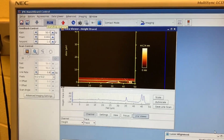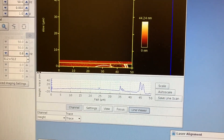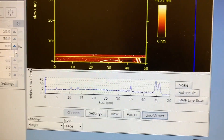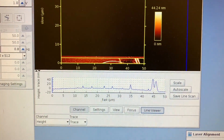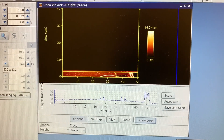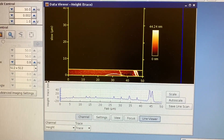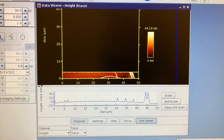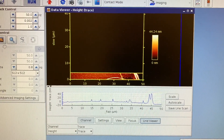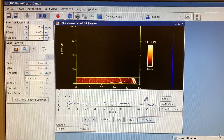Now it's finally time to hit run to start imaging our sample. After some searching, we found our first collagen fibrils. The tip slowly scans, revealing more and more of the topographical image. The bar on the right tells us what the height range of our image is, so any white portions on the image are at max about 44 nanometers in height. The height trace view below shows how the height of the features change as the scan continues in real time. Any gain-related noise or vibrational noise will show here, and if large enough, will be visible as small or large streaks in the actual height image above.